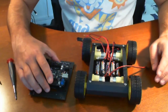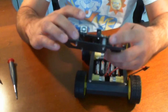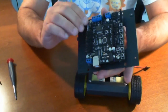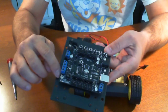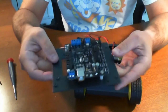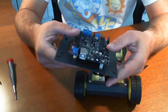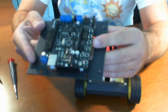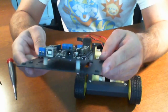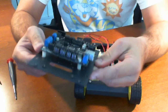We're back and we've gone ahead and mounted the board onto the upper chassis. What we did was put the standoffs — these white spacers — screwed them onto the board, then positioned it on top where we wanted it and marked the holes we needed to drill with a magic marker. Afterwards we drilled through with a regular DeWalt drill bit, put the standoffs through, and screwed them in with regular nuts on the back. That's the only customization you really have to do to this kit, which is good. A lot of kits require a lot more — expect just a tad bit of customization with robot building.